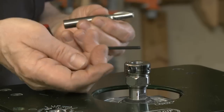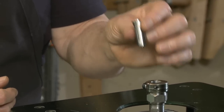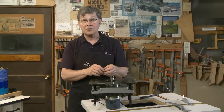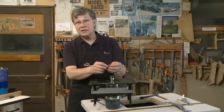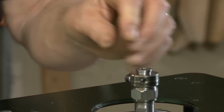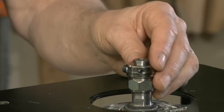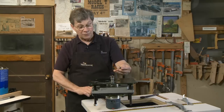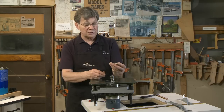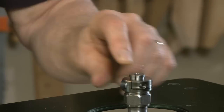These are only available with a half-inch opening — no one makes a purpose-made quarter-inch version. So what we do is use one of these adapters made specifically for the quick change collet. You don't want to use a traditional quarter-inch adapter for a typical collet because it tends to jam into place — it has different machining, different sizing, different slits, and it just doesn't work the same. Use a purpose-built adapter and just drop it into place. I typically like to align one of the slits on the adapter with the slit in the collet. Drop your bit into place, tighten it up, and away you go — it'll release easily when you take it out. Make sure the inside and outside are clean and don't get it oily. You can put a light covering on it to preserve it, but make sure you clean it off before use. That's how you adapt a quarter-inch bit to a quick change collet.